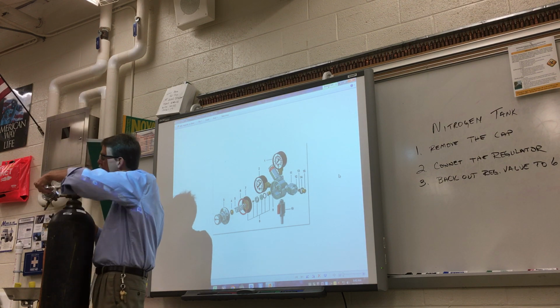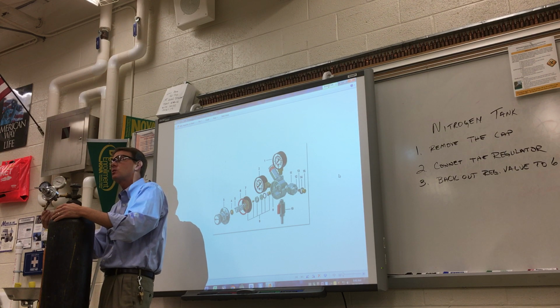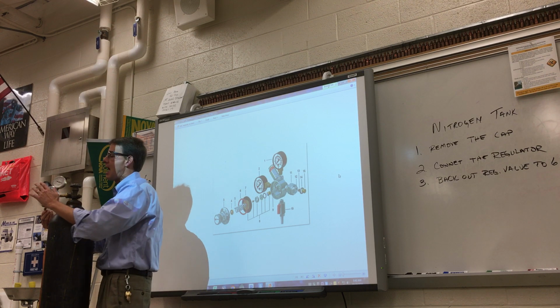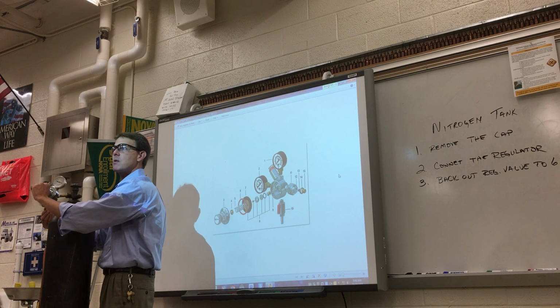But if you notice when I back it out, this needle doesn't drop, because of the pressure that's built up behind the valve. I've got to do 2 things at once. I've got to push in the Schrader valve and adjust the pressure to what I want. And you can hear it go down when I back this out.